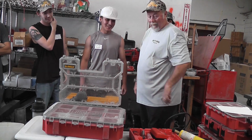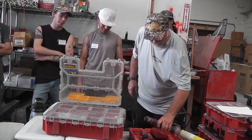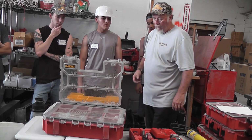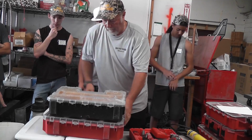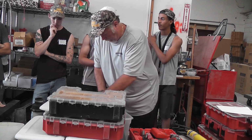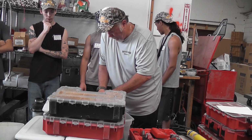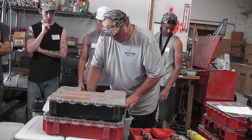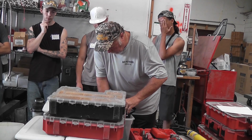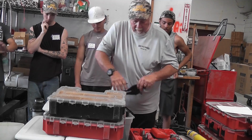So that's the new piping system that we use. It's called Uponor. What do you use to cut that? Use regular tubing cutters, just like you have in your box. When you're working with Uponor, you always want to make sure that you have 2 sets of tubing cutters. One set is made for plastic. The other set is Uponor only.